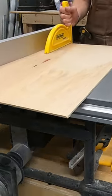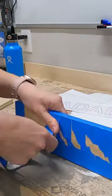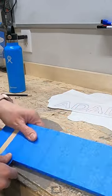I ripped a quarter inch piece of birch and a half inch piece of birch on my table saw to four inches. Using painter's tape I wrapped both pieces together with the quarter inch piece being on bottom.